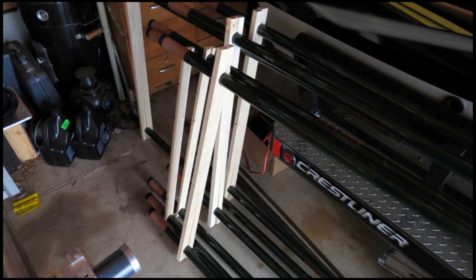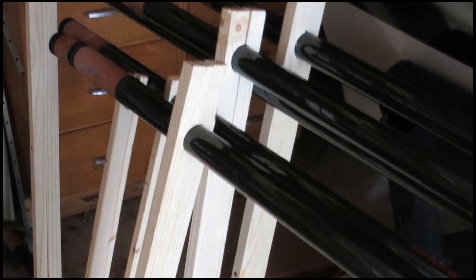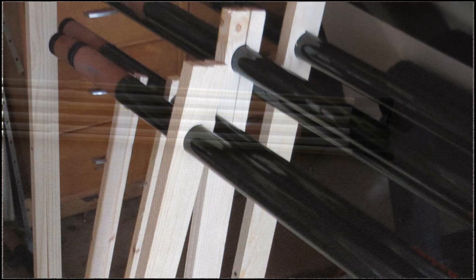I won't be using the elements until I am ready to mount them onto the boom, so to protect them in the meantime, I built a number of wooden clamps to hold the boom end of the element together. This was accomplished by taking a 1x4 piece of wood and drilling holes 1.5 inches in diameter, 30 inches apart. I then ripped the 1x4 in half through the hole so that each half could be screwed together around the element bases. This simple clamp worked really well to protect the elements.